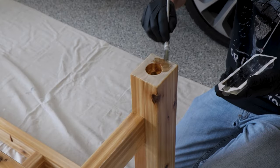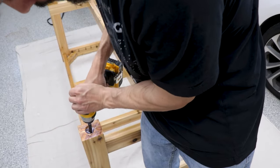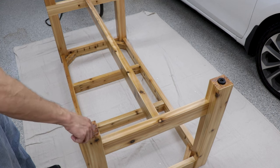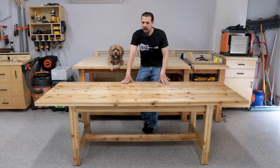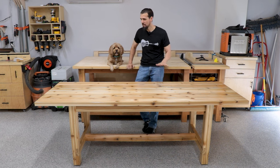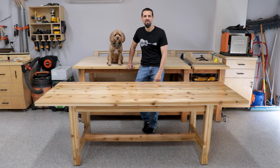Once all the screws are in and the spacers come out, we can move on to one of the last steps: applying a five-minute epoxy to the bottom, just brushing it on to make sure it's well sealed and won't soak up any water. I do want to mention we have detailed plans for sale in case you want to make this particular table yourself — it'll save you a lot of time. The final step is actually securing the top to the table using all those pocket holes we put in earlier, but I'm not doing that yet since I can't transport it to my friend's house for another week or so. We'll put the top and bottom separately and secure it once we get there. The project came out great and I'm really happy with it — if you like what we're doing, leave a comment, like, subscribe, and we'll see you in the next one.